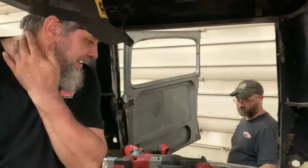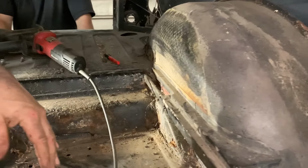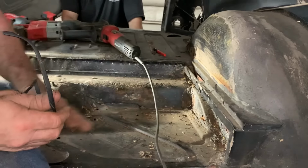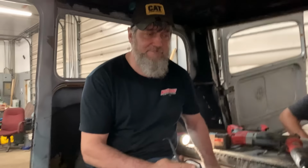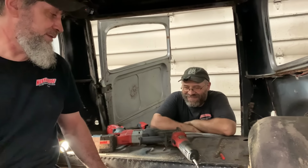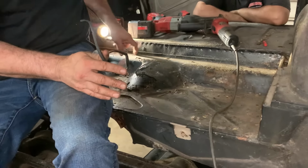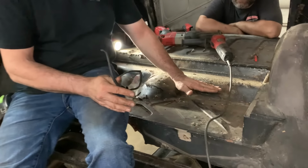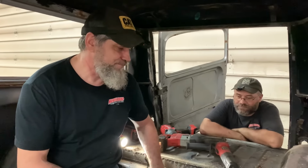All right, well, I think we got the front seats nailed. Now, the back seat fits right in here. It's a CJ7 seat. Fits right in here very nicely, but she's riding high on the humps here. We can't have that because Sammy's gonna have to ride like Dino with his head out the roof. So we're gonna cut the seat hump out here, back to here, and that thing will sit in there nice and flat, and Sam will be a happy man.